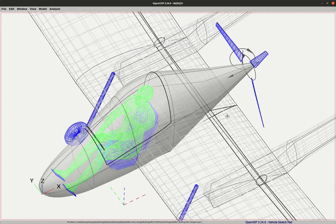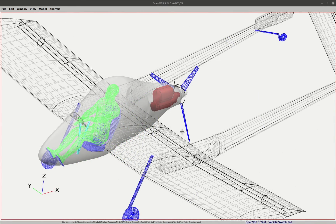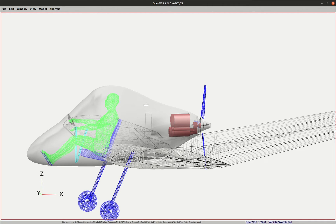We've gone from the previous fuselage shape to a modified one with changes on the aft end. Let's go over the changes one by one. As established early in the design, we have a pusher configuration. Looking at the left-hand view, the prop is not anywhere near a third of the wing chord behind the trailing edge — to follow Dan's footnote, it would have to extend out quite a bit further. To move it there would require considerably more structure, adding significant weight. The firewall will be located right where I placed the scoop for the cooling inlet — a bulkhead of thin stainless steel sheet.